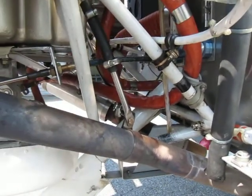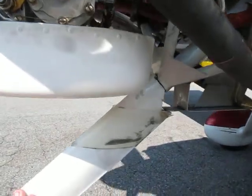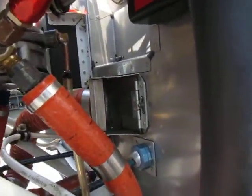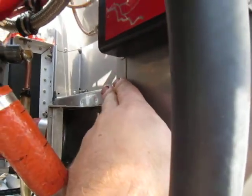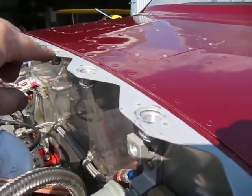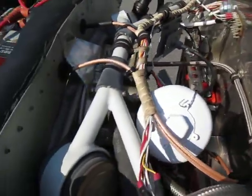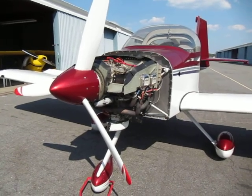These little devices are basically shock absorbers for the exhaust system. You can see that the landing gear connects right through the engine mount system. This little box right back here is for the cabin heat. The cutout in the firewall is made for engines which have a constant speed propeller — it allows a little more clearance. The firewall itself is very thin stainless steel, and the cowl is held on by these cam locks. This is just a strip of aluminum I riveted onto the firewall to retain the cam locks. So there you have it — a quick and brief walk around of the engine on my RV-7A here at DeKalb Peachtree Airport.